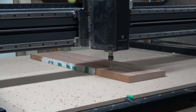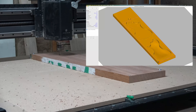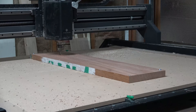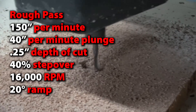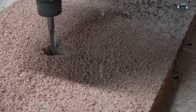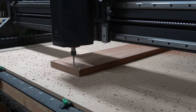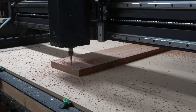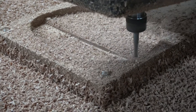For this first carving operation, I'm going to be cutting part of the neck cavity as well as the cavities for the inside of each body half. This body is going to be hollow in an effort to keep it as light as possible. For this operation I'm only going to do a rough pass — no finishing pass — because once the body halves are glued together it'll be difficult to see inside those cavities, and the F-holes just aren't large enough to really reveal anything.